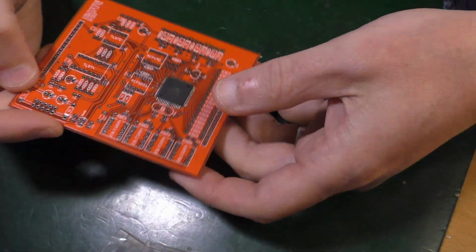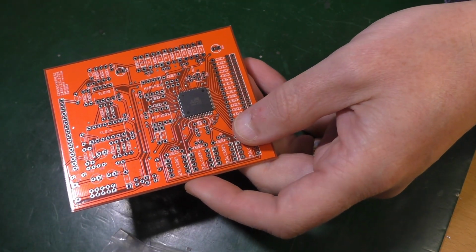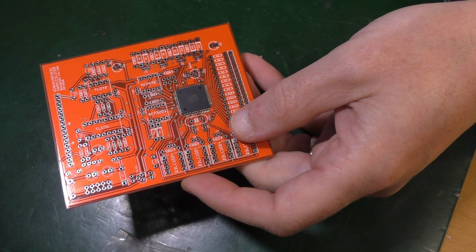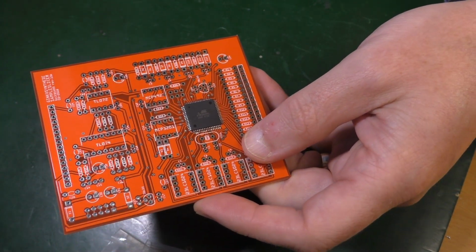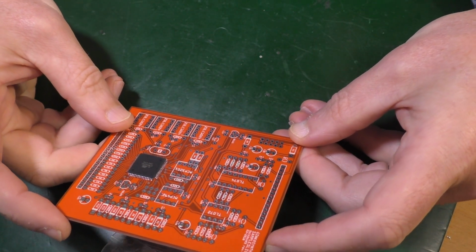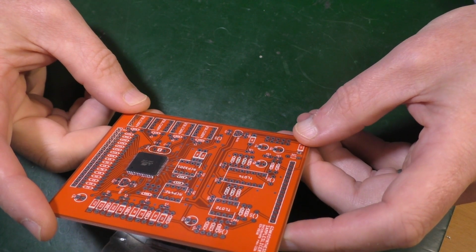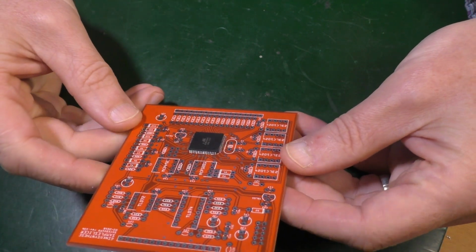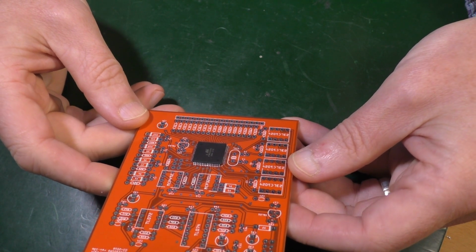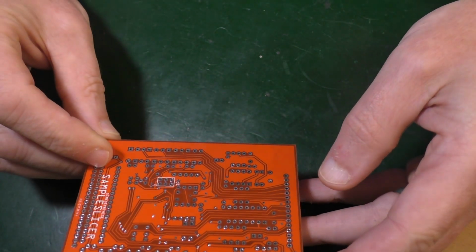So the order that they're saying things in is diodes, resistors, capacitors, then a crystal, then ICs and IC sockets, then more capacitors, then take a coffee. Alright. Now the screen print on the board is relatively small. My poor old eyes. I might have to do this whole thing with my magnifying glasses on. But that's alright. It's really well labelled, I have to say. As long as you can get close enough to read it.